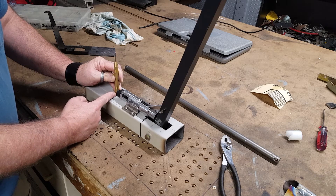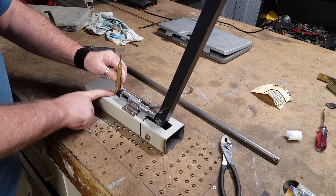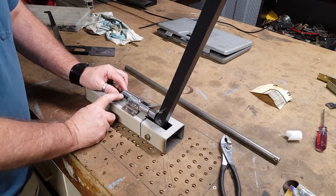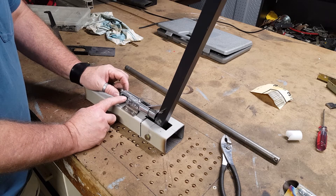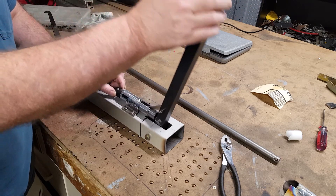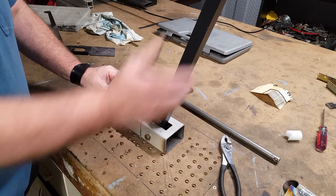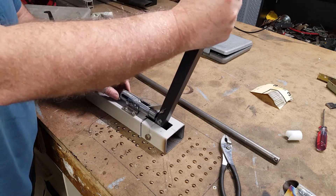The 3/16 at the bottom here may be good enough, or even maybe 7/16 — though that's getting a little large. A captive nut welded underneath, tapped through here — maybe try it out first to get the positioning. Basically there'd be a pin picking up the forming portion so that it can't spin. I haven't quite worked out how to keep this retainer — it's obviously great being pushed, but when it returns, this shuttle has to pick that up to move it back, else you just get really frustrated and beat the hell out of it.